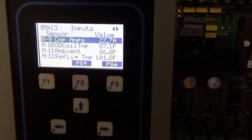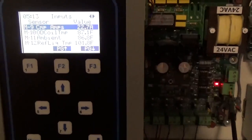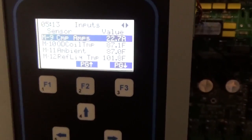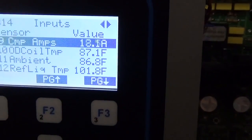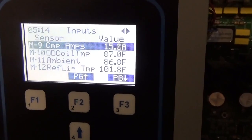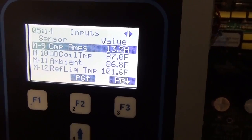Five tons of cooling — this is huge. This replaces all the heat pumps and most of the water heating load in an American home. That's what I'm excited about: can we do it off solar? Five tons — 60,000 BTUs of cooling and heating simultaneously. The controls are all digital; there are no manual controls. The control panel lets me go through menus, make settings, change everything from the RPM of the compressor. If I was getting close to the maximum amp draw of my inverter, I could back it off right here.